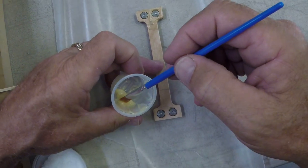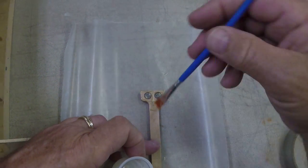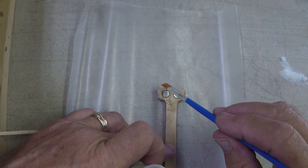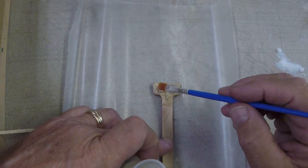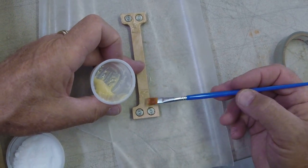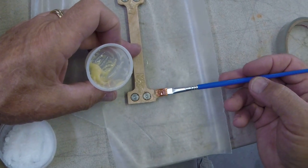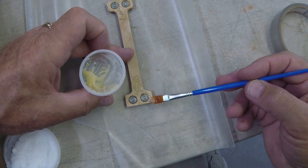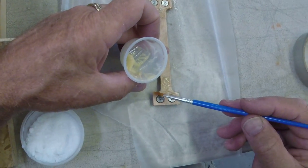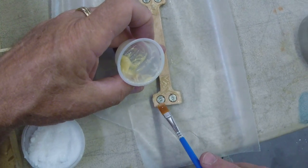What I would normally do here is use PVA. Why do they call it that, by the way? Somebody leave me a comment. Let me know why it's called PVA. Anyway, it's a product that I've shown you in some of the other videos. It's a release agent. It just coats a part lightly, and then you can get epoxy all over it, but it'll still pop free later. It's what a lot of guys use in their molds when you're making new parts, and it helps the part pop out of the mold. I don't use it. I've found that as long as you wax the mold up really good, the part will pop out just fine, and you're not having to deal with spraying PVA.